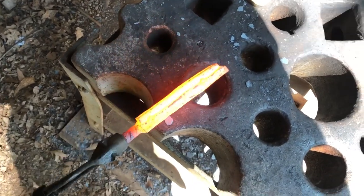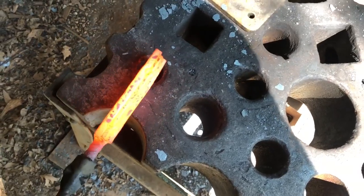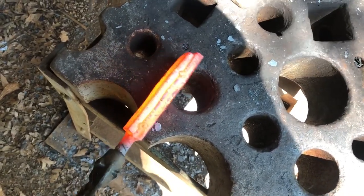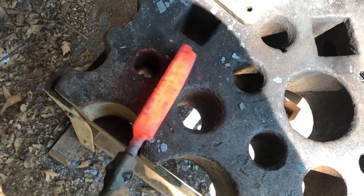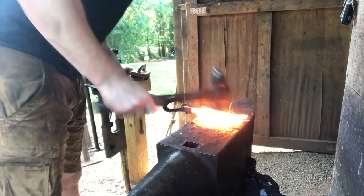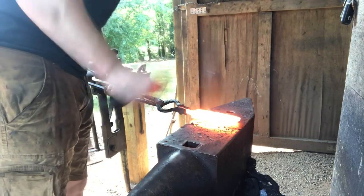After the first few welding heats, it feels like it's stuck real good. I was going to cut off that messed-up end where one piece of iron is overhanging, but it's actually pretty handy for keeping track of which side I need to work — I don't want the wrought iron getting too much thinner on one side. Now we just have to flatten this out into bar stock we can make a blade out of. I'll take it through welding heats to avoid stressing the welds and splitting the grain of the wrought iron.